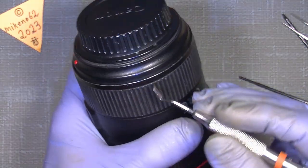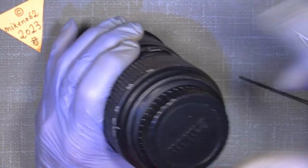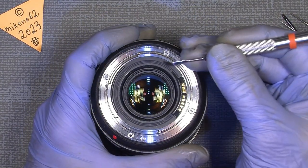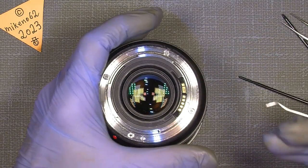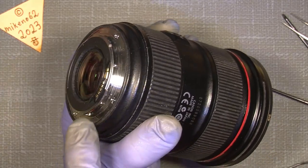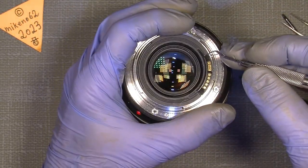I think maybe I need to take off the zoom ring to get in, but I don't think so. Just take off the back cover here. I'll need my spade tool to get off the plastic back ring here, which sits around inside the mount. Also need to loosen — unscrew the two screws here on the contact bridge, and of course the four screws around here for now.